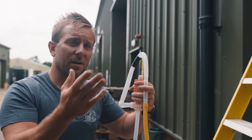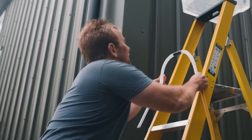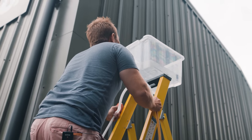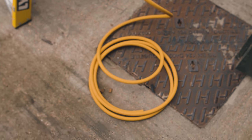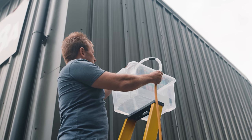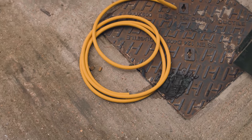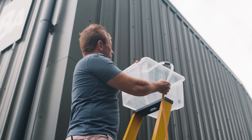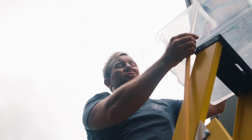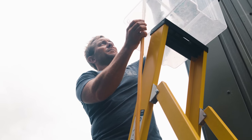Sometimes you'd get a special bit of copper, make a crook out of it, then you go downstairs and you start sucking on the hose. If you've ever done that with an oil tank, you'll know how brutal it can be. So let me just very carefully go up here. Pop this in here. Now look down there at the hose right now where it comes out — there's no water coming out at the moment, is there? Nothing. Now look, I'm gonna pump this. One, two, three — and there we go. That's now siphoning. So look down there, and that's it, it's off. And we'll siphon this out so quickly, and that's why this is so good. If I wanted to break the siphon, I'd just undo that nut at the top and that would do exactly the same thing. There you go. That's done.